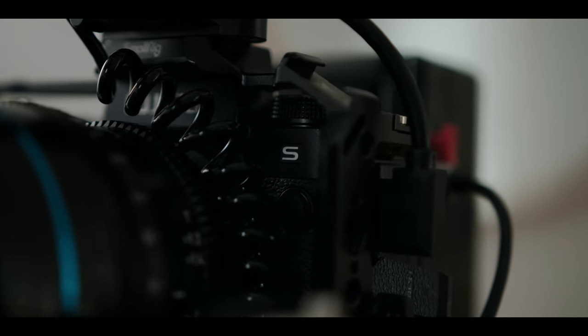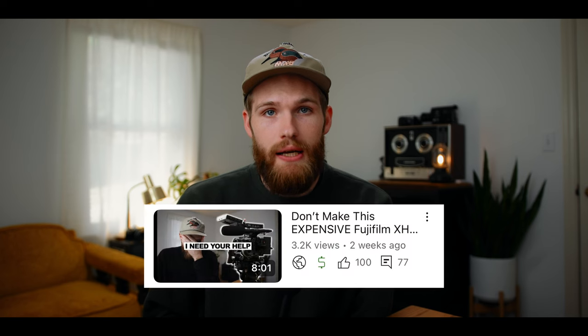In the process of making this video a few weeks ago, I actually broke my X-H2S and sent it in to Fujifilm for repair. There was an issue where I fried the HDMI port with the V-mount battery I was using. I believe this happened due to plugging in the cables in an incorrect order. Feel free to go watch that video — a bunch of people left awesome comments explaining best practices for using V-mount batteries to prevent breaking your camera like I did.